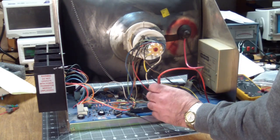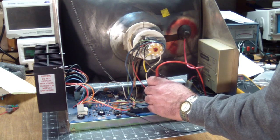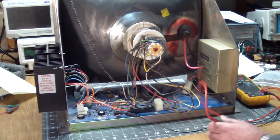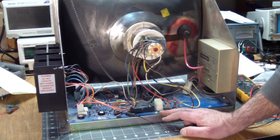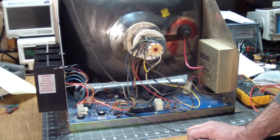And 8 reads in low kilo ohms. Quite different, but that's because that feeds something totally else. Different part of the circuit, so I don't know, maybe missing the 27 volts caused something in here to start drawing a lot more power from the minus 25 volt line, which eventually made it trip too. But we won't find out till we put it back in the game.